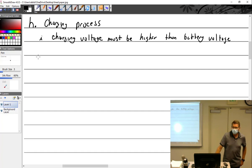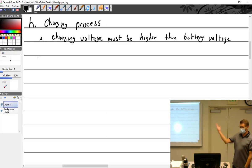So here we are, flying along at night and it has two incandescent 150 watt light bulbs on there, whatever they are. And so you turn on your lights and you can look over your ammeter and it's pretty much at zero. So what does that tell me? Maybe positive two. What does that say? Battery's charging. Okay, everything's looking good. Go ahead and pull the power back, carb heat, power back to start your descent. Lights get a little dim and I watch the ammeter slam all the way over to the left side and now it's negative 15.